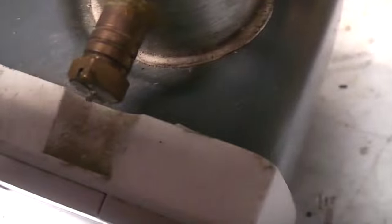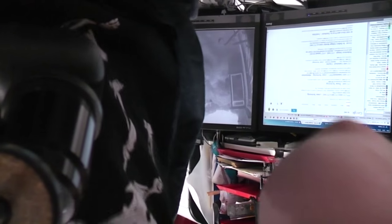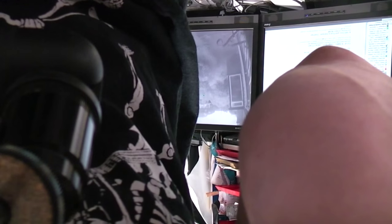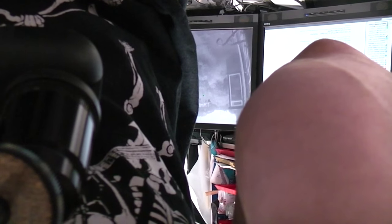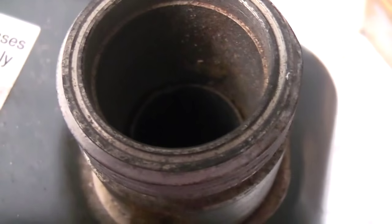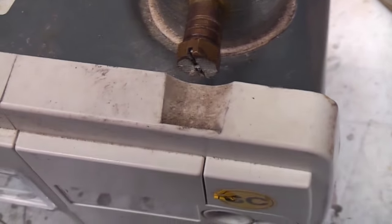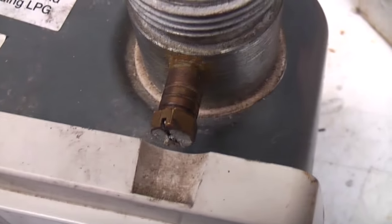Something I've just noticed with this on the bench is you can actually hear a very slight tick from the ultrasonic sensing in here. Let's stick the microphone right up to it and see if you can hear it. The instrument seems to only be going about a couple of times a second, so I suppose one way of subverting this is to arrange something that actually takes gas in bursts in between the measurements.